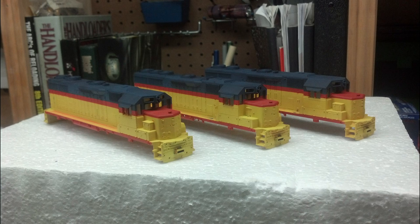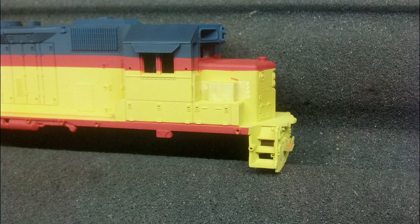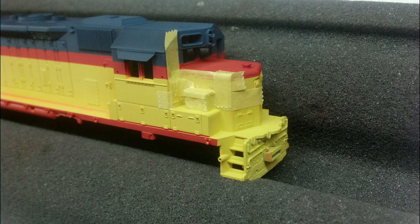We had just put the blue on top of the locomotive, and since we had that paint already mixed, we decided to go ahead and paint the catwalks or the walkways — the exterior part of the locomotive where, if you were standing flat-footed, your feet would touch. We have walkways in front and rear above the anti-climbers. What we want to do is tape off everything above that area on the inside and everything below that area on the outside of the locomotive.